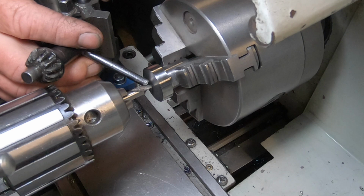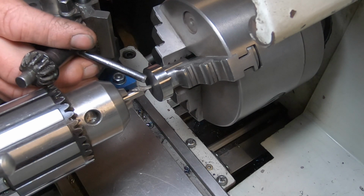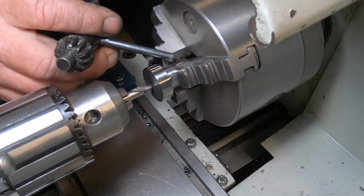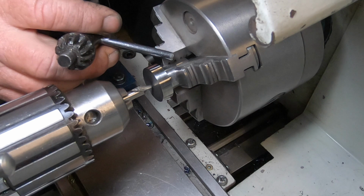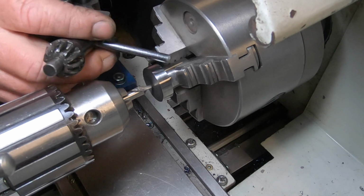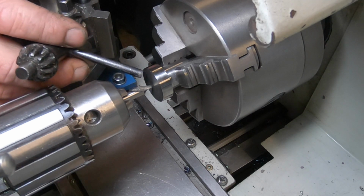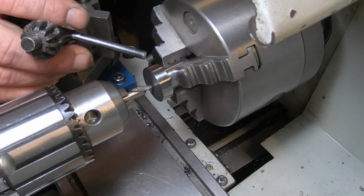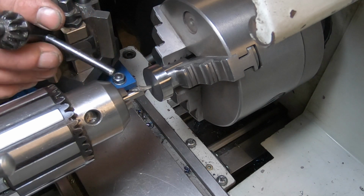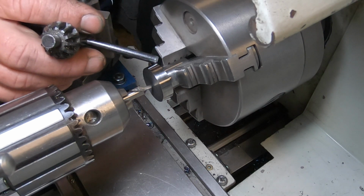This has got to have a reamed 3/8 hole to take the broach, and the depth is critical. According to Tommy, you've got to have it spot on. It's got to be 20mm deep, spot on. So I'm going to center drill it, spot drill it, and then drill it, ream it. I've just got to work out a way to measure exactly how much to drill it.